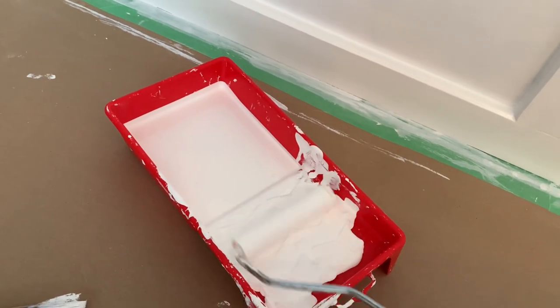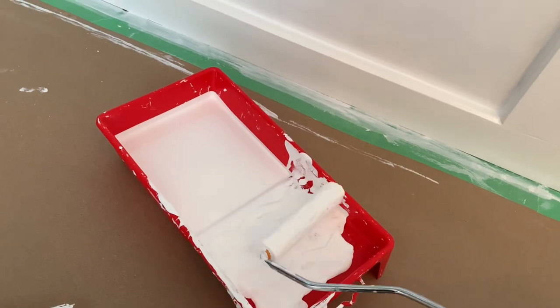So I really, really love the Advance paint. It was self-leveling, which made any little imperfection work itself out. You still have to put on a thin layer like you did with the primer and just build it up. But I thought it looked beautiful, and it dried so super hard, so you don't need to do a top coat, which is a bonus.